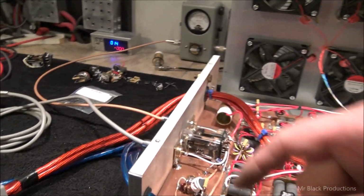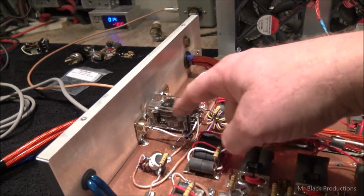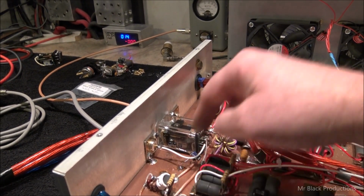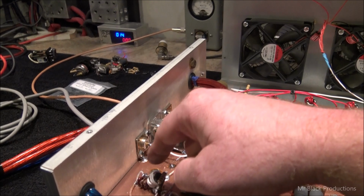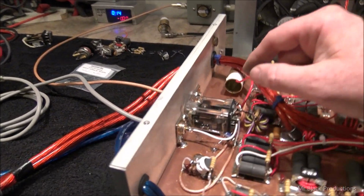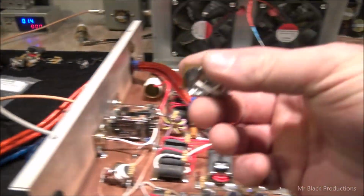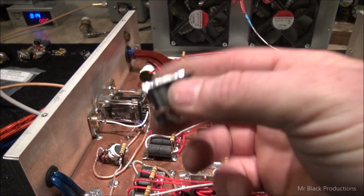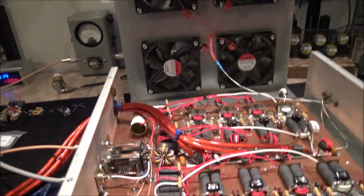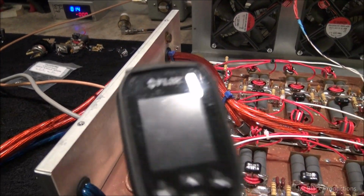So the splitter circuit, let's talk about this. The RF comes in primarily from this coax connector, comes across, and it was just a piece of wire. I changed it out to a piece of coax so it could be balanced. Sorry, I'll get that in frame. This splitter that was in there, of course I changed the wire that was on it, playing with it. But the splitter that was in there was getting screaming hot. I could sit there and look at it with the FLIR and I'd be like, oh shit, that's 180 degrees.